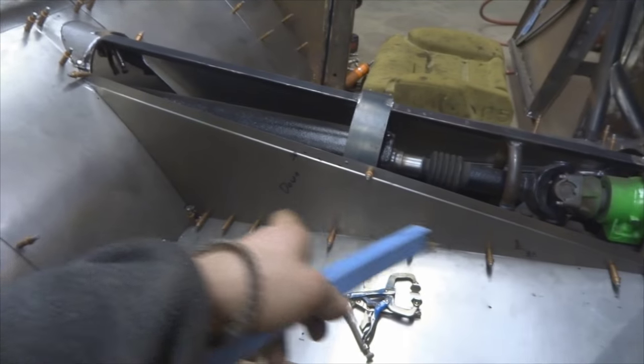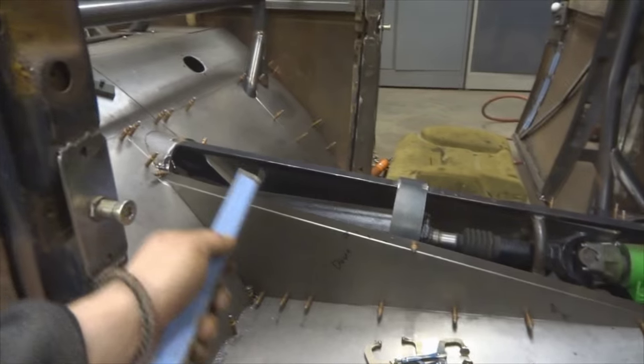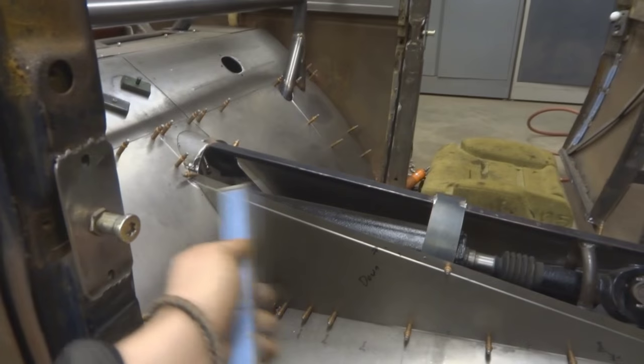Right here you can see that I made these panels and I have them Clecoed in for the most part. What they do is they come up from the corner of each radius so that this piece is straight, and all I have to make is the radius top. It's easier to make it in multiple pieces for something like this because the radiuses are all different.